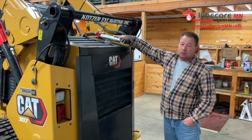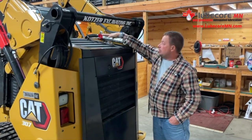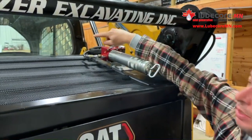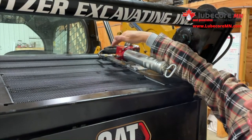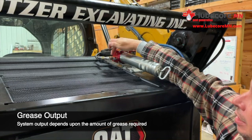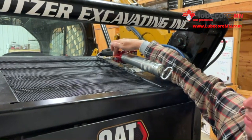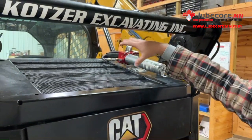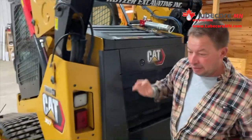It uses standard grease cartridges. The pressure to operate the pump comes from the boom cylinder — every time the boom goes up, it delivers one stroke of grease. As you can see, it's very compact, very small, uses standard tubes of grease. We did integrate a pressure gauge so the operator from his position can turn around and confirm that he's seeing pressure on the grease. There are different size metered injectors and these range in displacement, generally about a fraction of a cc every time the boom operates. From there, we're following a main line down — most of the components are tucked underneath.